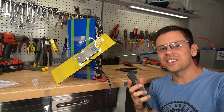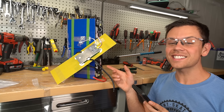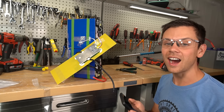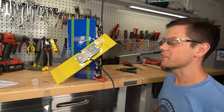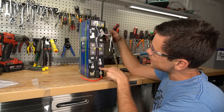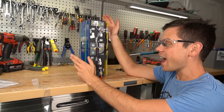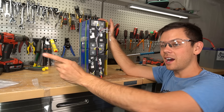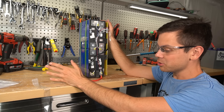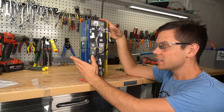With everything said, I still think these will outlast a lead-acid battery. But I would not trust the marketing material. For these to be at 81% capacity means these were cycled very hard — probably at higher C rates than you could ever imagine, maybe 3C or 5C or something. You really have no idea. There's no way to tell. The crimps and the connections and the balance leads — all of this is actually pretty nice. Now, would I personally buy this? I actually cycle grade B cells every day. Behind this camera there's a 30 kilowatt hour bank, and I use it to charge my car. I do not recommend my viewers do that, especially if you don't know what you're doing. But these might actually last longer than a lead-acid battery.